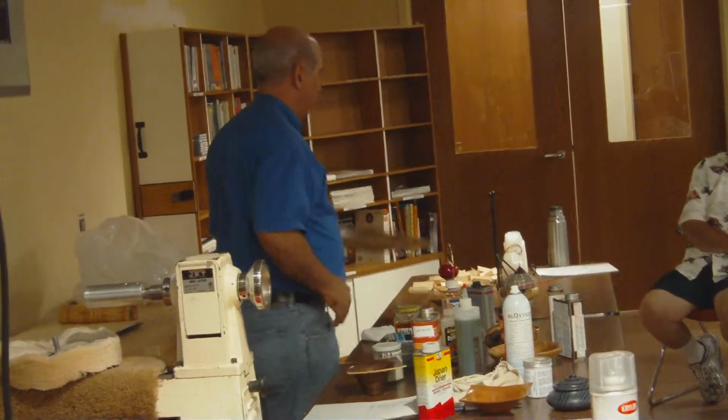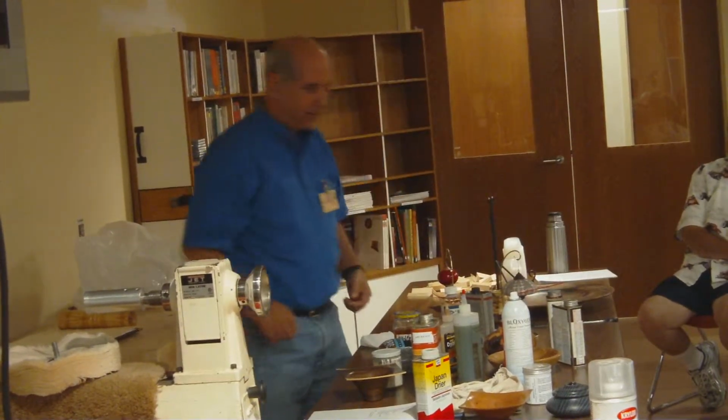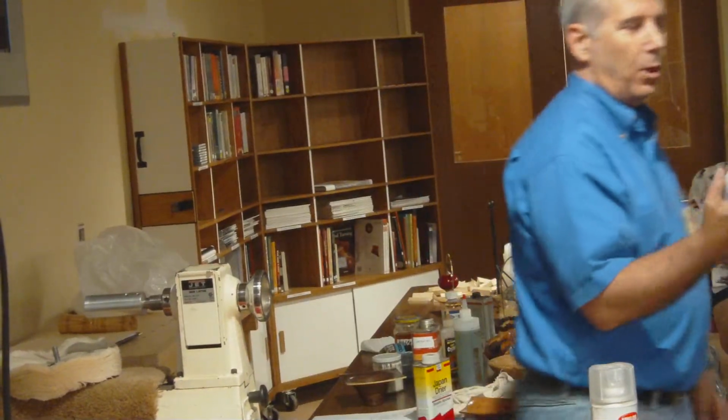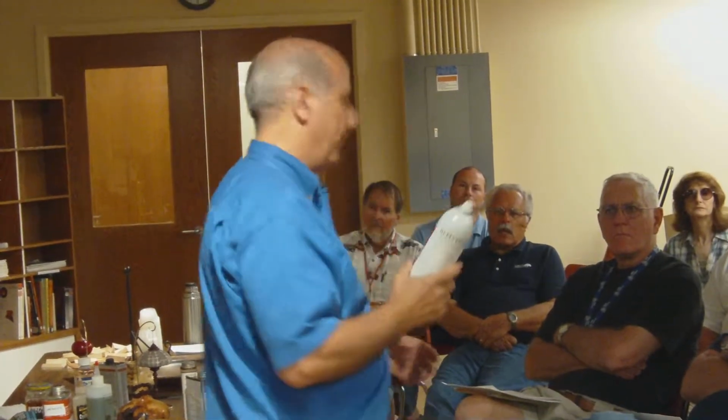Finishes gel in the container. I like this thing called Bloxygen. It's an inert gas; it says in here argon. This costs 10 or 12 bucks, and I use about two a year. Every time I open a can, after putting another layer on this piece, before I close it up, I give it a 2-second shot just under the cap and put it back on.